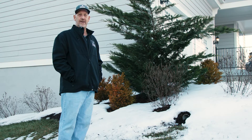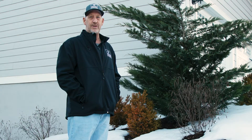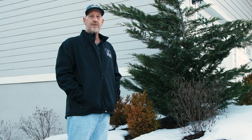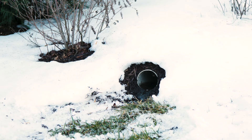Attached to your gutters on your home are downspouts, and we also attach the daylight to the downspouts. The reason for this is to make sure the water goes away from the home and not anywhere near the foundation. For maintenance, make sure that the downspout or daylight is cleared of debris in front of it to prevent water from being blocked.